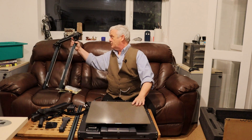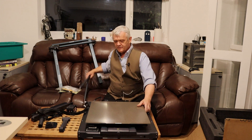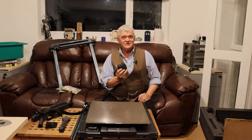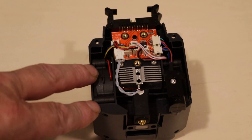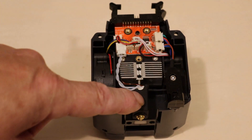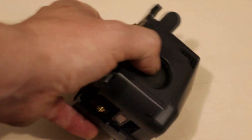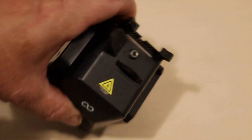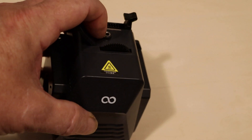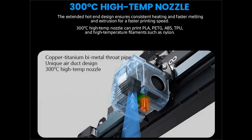Out of the box, the machine comes in two basic parts: the bed and the support arm for the print head, held on with four bolts. They've given a couple of extra support bars to keep it stable and upright. Looking at the reverse of the printhead, it's very uncluttered. There's a 60-watt all-brass hot end with a ceramic heater underneath that rubber shoe, very clean and neat electronics, and the front end has cooling ports and a dual gear feed.